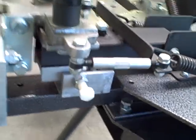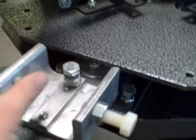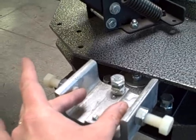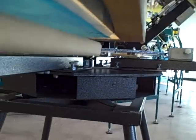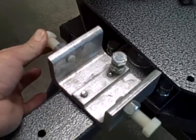I want you to see where registration takes place. Workhorse does something on the Odyssey machine that I'm proud of — we use a very wide registration fork. Wider is always better when it comes to registration. That fork comes down between two synthetic bolts. Some manufacturers cheap out and use metal on metal, using metal wheels or roller skate wheels. We use special synthetic bolts so we don't wear out the precision print head. This comes down into place very effortlessly and quietly, without any clanking noise like other machines.